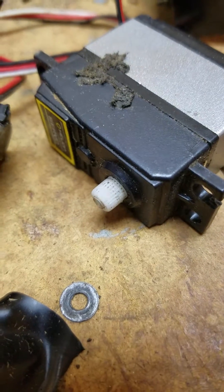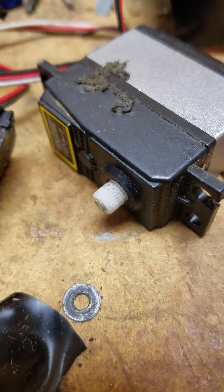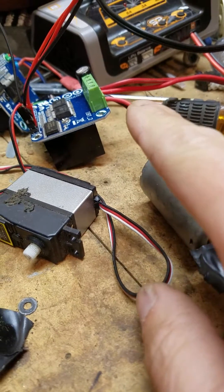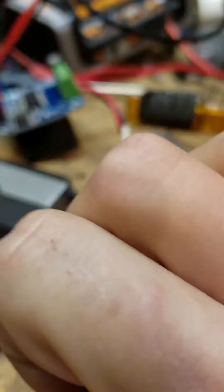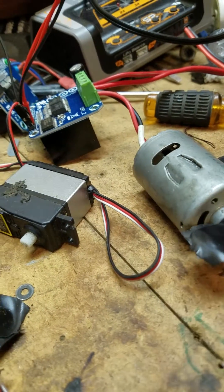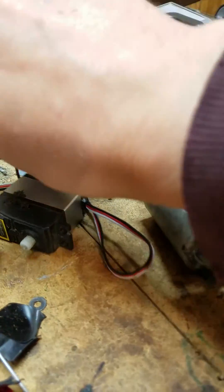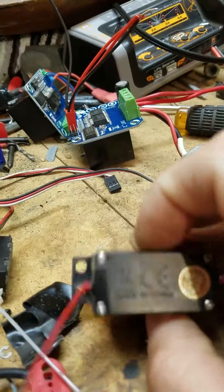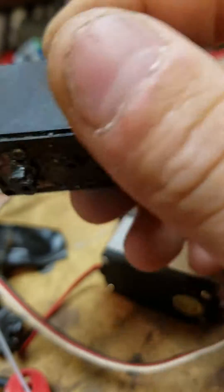As you can see, I leave all the gears inside — that helps. It's kind of like auto-home. That right there will stop the potentiometer and stop this at the same time, so you won't have it go all the way over and all the way back. I've had that happen several times every time I took the gears out. The only modification I do to these servos is I take out the screws and then I solder two wires. That's the only modification I do for my giant steering servos.